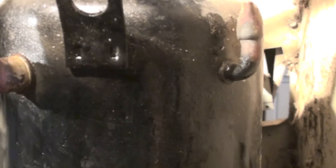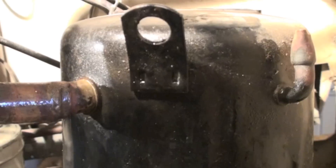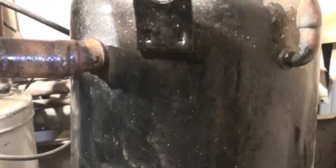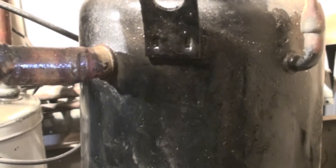So this thing, if anything, I'd say you've got too little superheat. One of those things that service techs probably never will figure out is why one unit will act a certain way and another one will act a little different. This one, it looks like you couldn't overdraw it regardless of what you did. I have not been able to bring a 100-degree return air on these things, but if I get a chance I'll try that. It doesn't look like this thing's ever going to go higher than about 75 in that section.